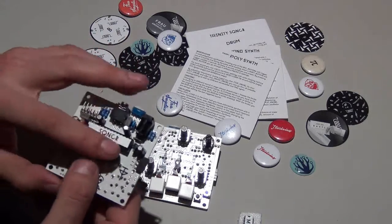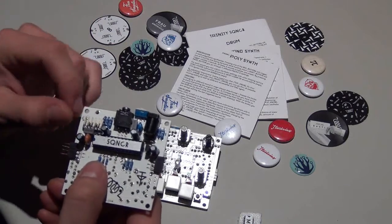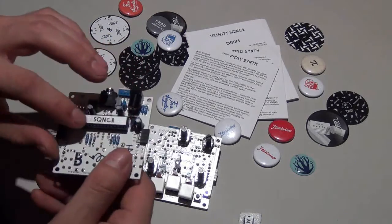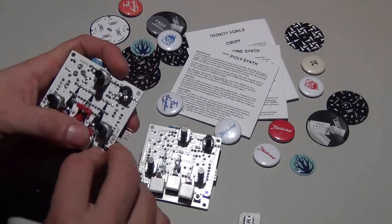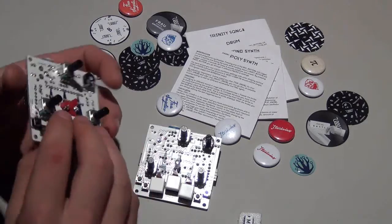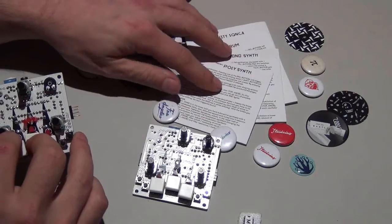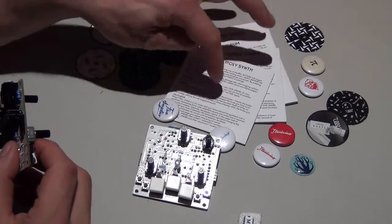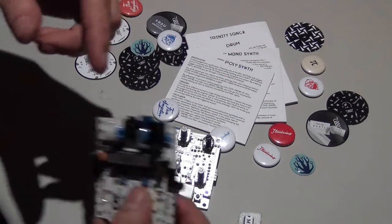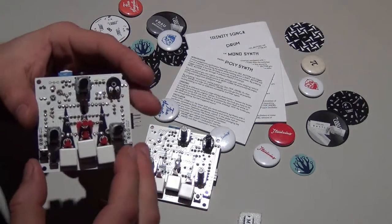It's all based on this Arduino base, which is why you have this hack connector. You can use an FTDI connector to program the chip and write into the program. If you don't like the features they've built in, you can change them. If you don't like the ranges of the switches, you can change those too. Each module comes with one of these manuals that describes the names of all the buttons and knobs.